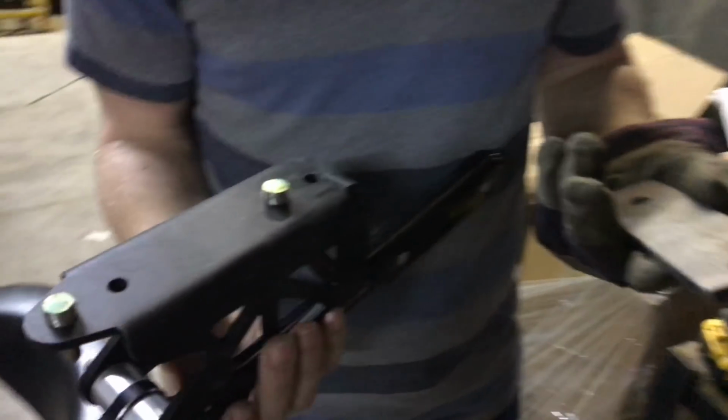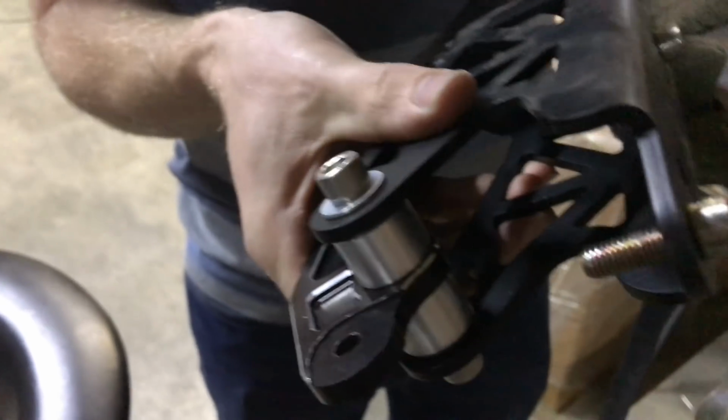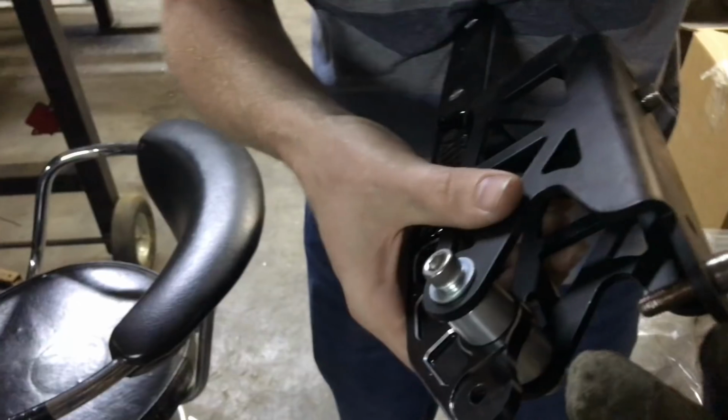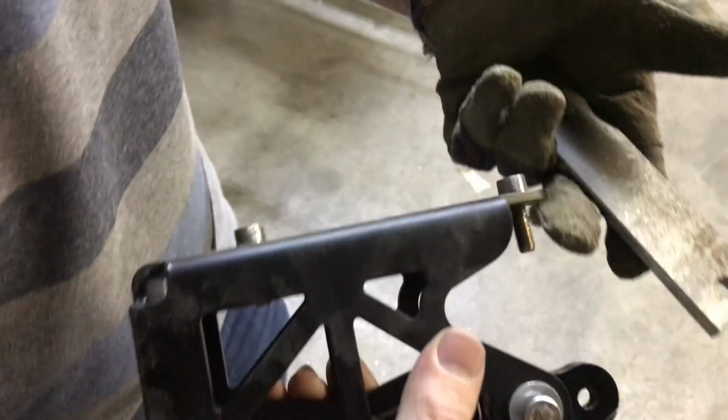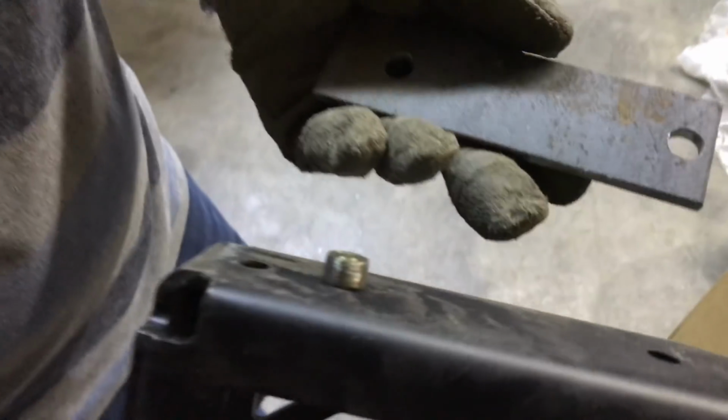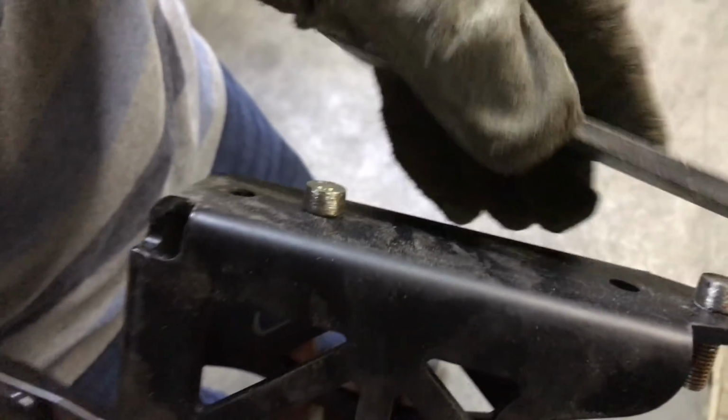All right, I thought this was really cool looking. So he circled those boys. Is that what you did? You made drilled circles out of them? Well, no, I drilled these holes exactly where they needed to be for this bracket. Then I stuck the bolts into a chuck on a drill, and spun them against my grinding wheel until I got them the size of my holes.